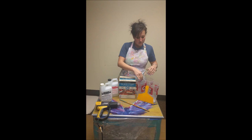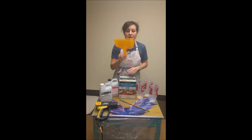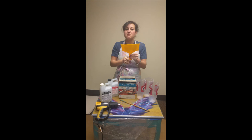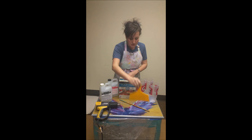You're going to need three cups: one to measure A, one to measure B, then pour A and B together and stir. You're also going to need your heat gun to pop any bubbles. And you're also going to need this adhesive spreader — I discovered it and it's amazing. They're only a dollar. It's hard plastic with little notches, and it makes spreading super easy so you don't overwork the epoxy. That's the number one thing people mess up — overworking it. You don't want to do more than three passes and this is your ticket to it.